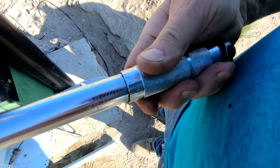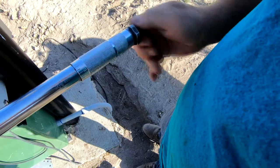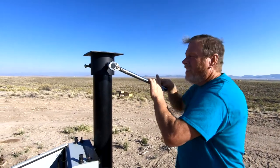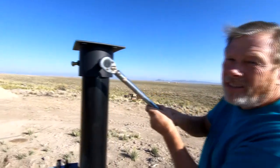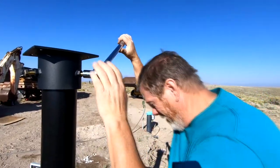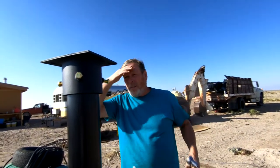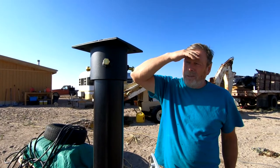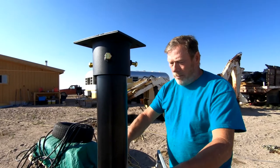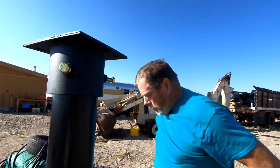There's 10 pounds, and there's 20, and one, two, three, four pounds. So I set this at 24 pounds of torque. I've already tightened, so I may already be there — it'll click and let me know. Did you hear the click? That lets me know I'm there. Don't go any further than that. I'll come back to this in about two weeks after we've had some good wind, and re-torque them to make sure they've stayed nice and tight.